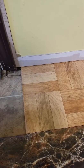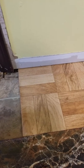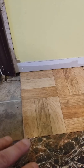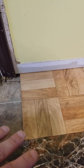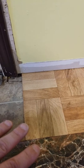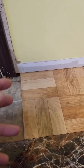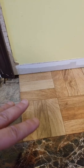When you're laying tile, the cement you're using has to be used that day — really within a very short span of time — and you can't walk on the tile while it's curing. You have to let that cement cure completely. If you try to walk on it too early, you will really screw up the work and have to start over from scratch. You'll have to remove tiles from the floor, remove the cement, re-cement, relay it, make sure it's square. It's a mess if you walk on it too early.